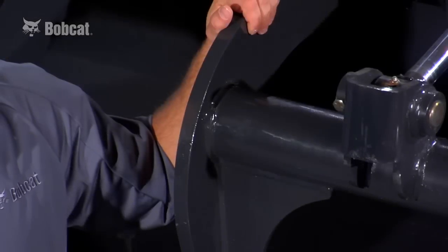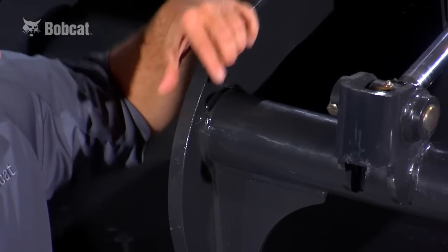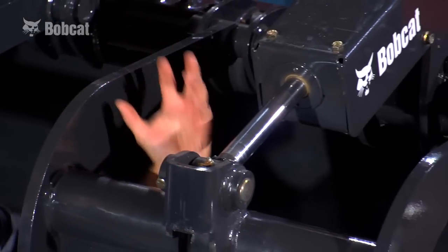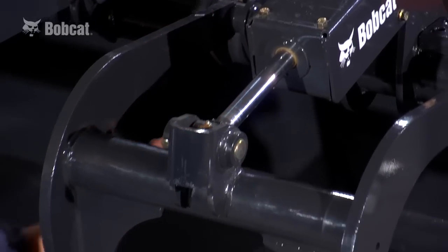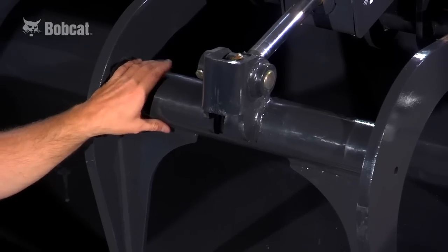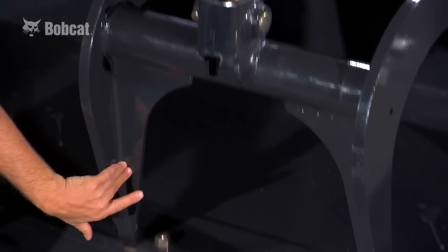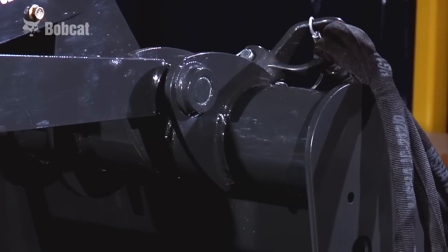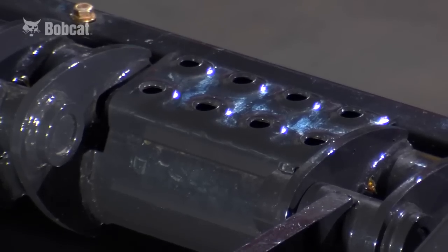are simply built better. Bobcat uses more steel in the grapple tines. It's 3/4 inch thick. The large open design makes it easier to see your work. Tines are reinforced by this 4-inch cross-section tube, then gusseted to the end of the tine. It's all welded nicely to a 6-inch mainframe tube with safety steps.